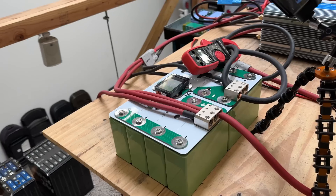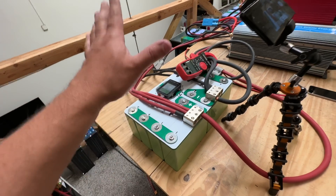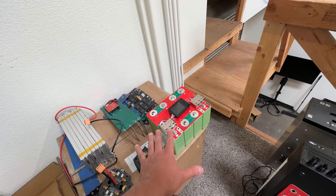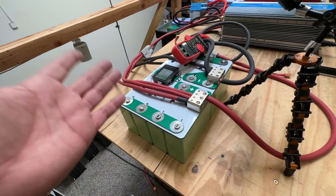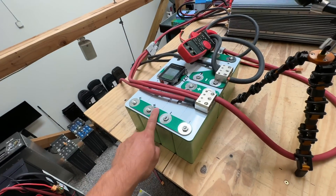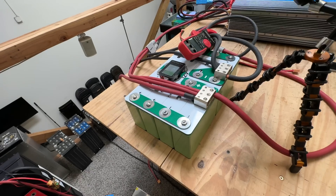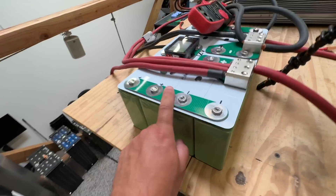Battery time — we are going to test this beast of a battery right here. These are essentially two of this guy right here, and we tested those already. We know these can do 600 amps up to like 20 seconds or something like that. So this one should be able to do about 1200 amps. I don't have 1200 amps to load it, but what we're testing here today is to see if these bus bars are up to the task — 1200 amps or anything above 800 amps is serious, serious stuff.